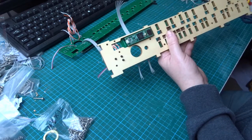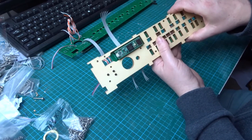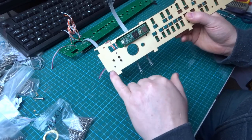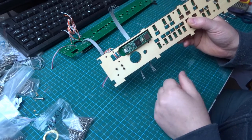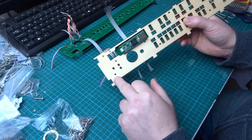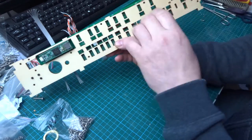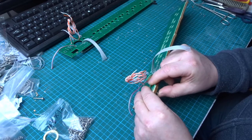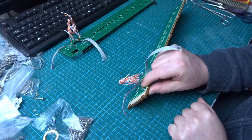This is for your large push button. Then there are bolt holes — not all of them are bolt holes. These three are for the cover that goes over the Teensy, so you need to bolt this together: that's two, three, four, five, six, seven, eight. The ones I'm using here are 12mm and they go through fine, giving you just a little bit on the end to put a nut on without too much trouble.